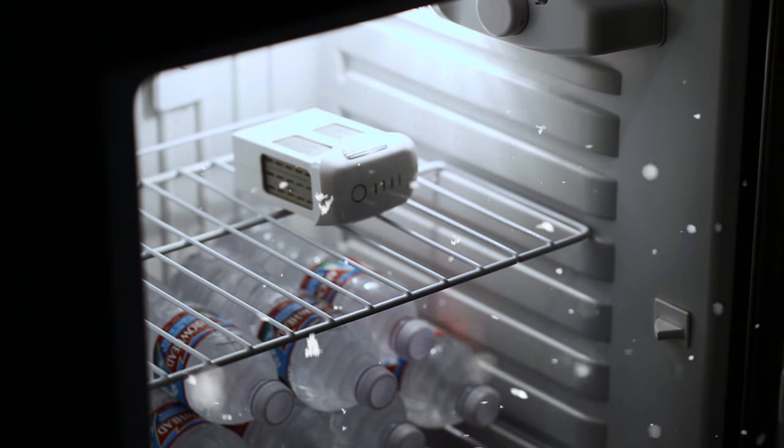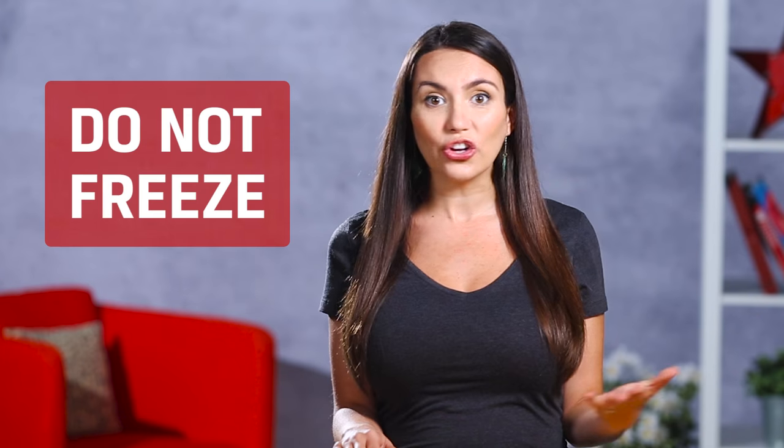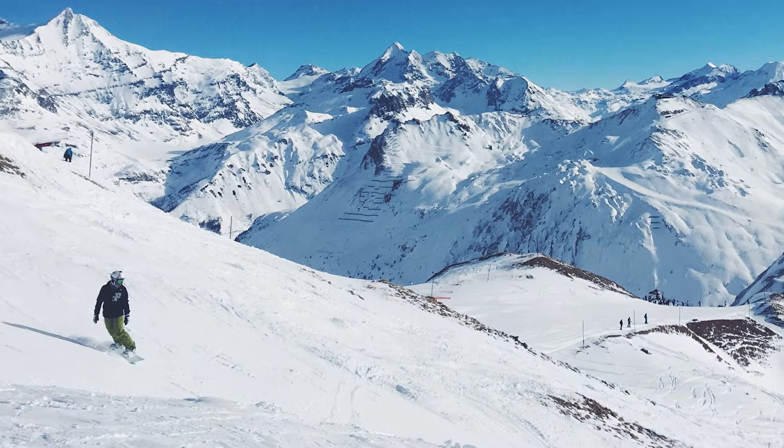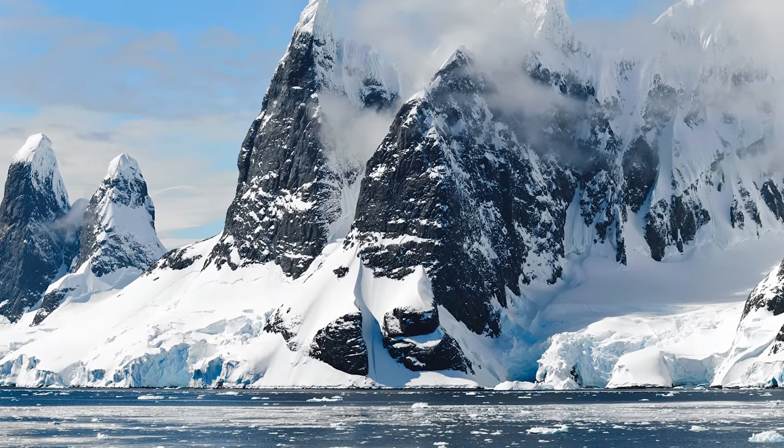In fact, don't do that. It's extremely dangerous to put a frozen drone battery on the charger. The chemicals inside these lithium polymer batteries could have an explosive reaction to being charged when cold. If you're out shooting some snowboarding footage or just a local winter landscape, be sure to bring any batteries to room temperature before charging. This will keep you safe and your batteries lasting as long as possible.